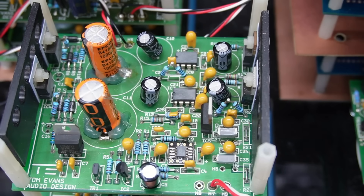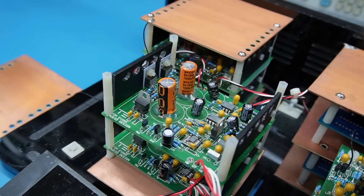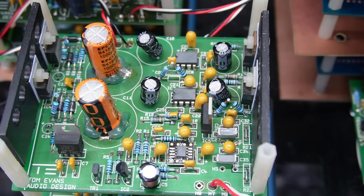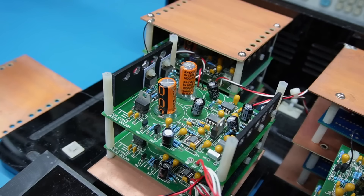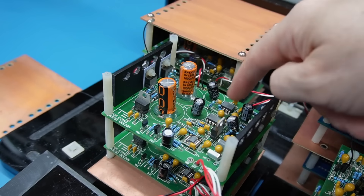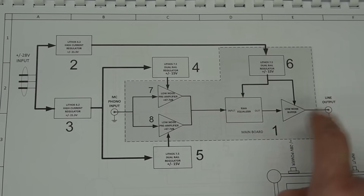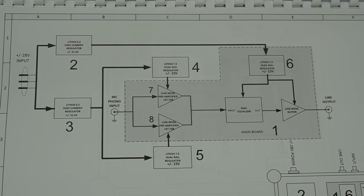I don't really like the way that these very large electrolytic capacitors have been just hot glued down onto the PCB like that. Also the way that the plastic separators have just broken off like that — the screw bases — is just, in my view, really not acceptable.